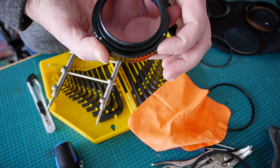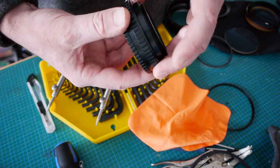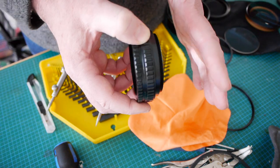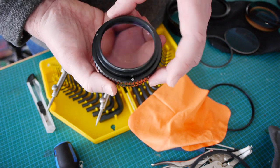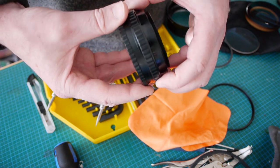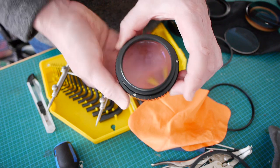I really should take this lens out. We'll see if I damage it. It's basically a diopter, this back one, of like plus 11 or plus 12. So you'd have to get a plus 10 and then add a plus 1 to the front of it, back to back, and stick it in there to get something similar. Maybe a 67 millimeter, just grind it down, or a 62 and put it in there with some tape as filler to bring it out. Actually, I'll measure this and see.